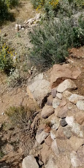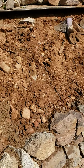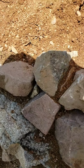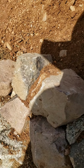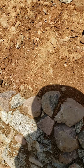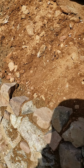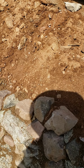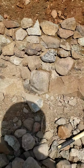And all it takes is dirt, rock, time. You just preferably set the rocks contacting one another and literally cram it in. I'm using local soil here. Over there by the bridge I had brought in 3/8 minus, which was pretty effective. It's just a matter of packing the material behind the rock. It's a little tedious. Of note also, over there we were sitting on bedrock.